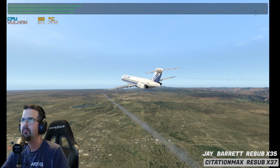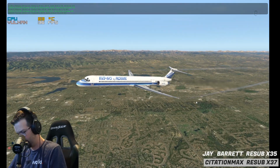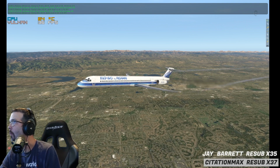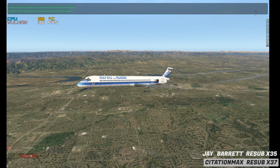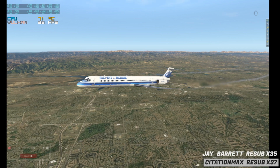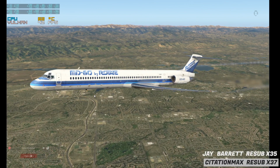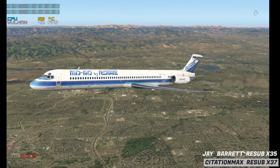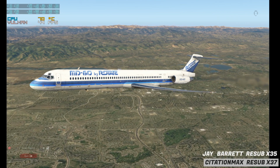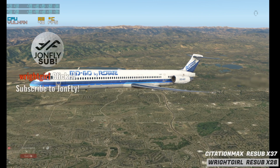I was asking earlier about that high pressure bleed off switch. If you're going to use that in an abnormal, which is the left or right air conditioning supply temp high, which is a pretty big deal actually in that airplane. So that's where you're going to go to high pressure bleed off. It takes it from the, I can't remember the stages anymore, I'd have to look it up, but it takes it from the high stage, puts it in the lower stage of the bleed air, off the engine, to cool down the supply temp, without losing that pack for pressurization purposes.